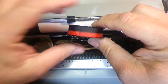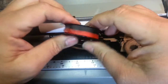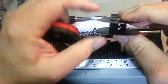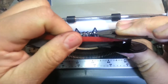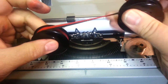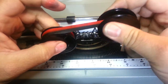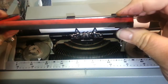You can get this ribbon from anywhere, including here at PhoenixTypewriter.com. Just wind it onto the spool — the direction of your initial wind doesn't matter. Then connect it to the other spool — again, direction doesn't matter. There's a little tab and a little fork in there; just get in and connect it up. Then wind just three or four turns so you get some ribbon wound onto the core.